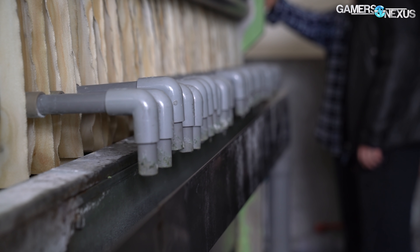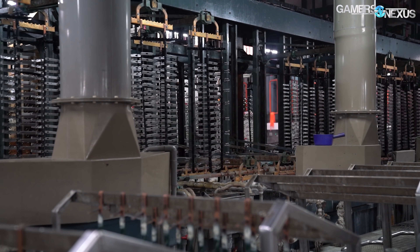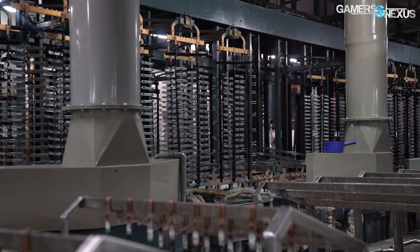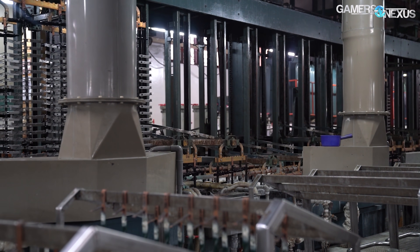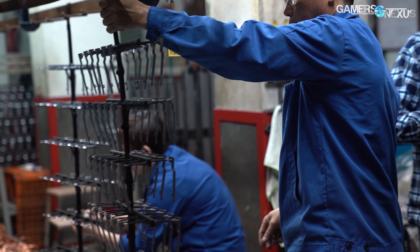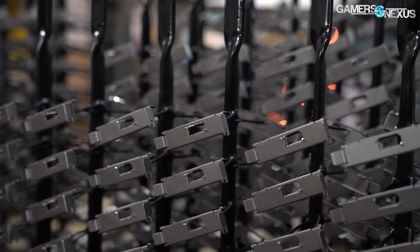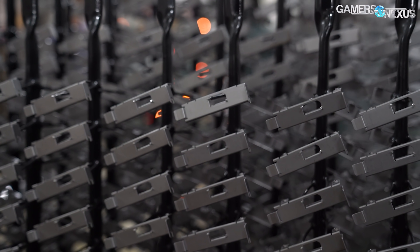This factory electroplates metals using two different methods: rack plating and barrel plating. Rack plating is the most closely related to the anodization and EPD processes that we've seen thus far, but this factory is larger than the others we've visited and has some unique features. First, the parts are placed on conductive metal racks and washed off. The racks may look like they're fully sleeved in insulation from a distance, but they're topped with thick copper hooks and the prongs that contact the parts are also bare metal.